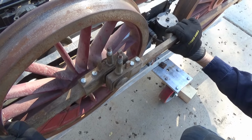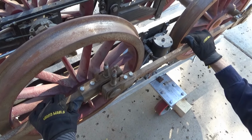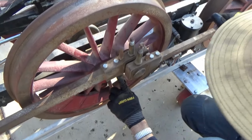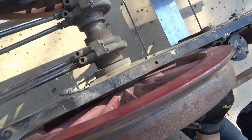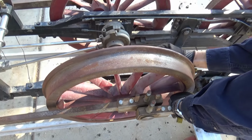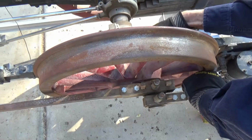The valve gear had similar means of take-up, so we have a smooth and tight running mechanism front to back. Now in this case we have main bearings here which do not necessarily have the same form of take-up. In fact, the bearing that holds this axle has a set of wedges that are screwed up from below, so you can adjust the box of the bearing and move it slightly forward and aft as it wears in the pedestal jaws of the frame.